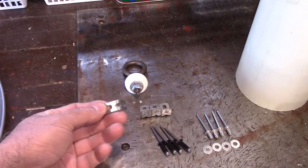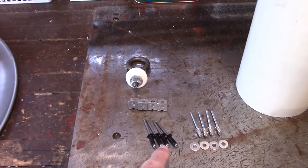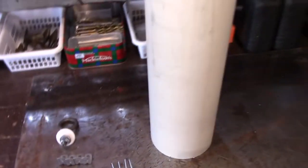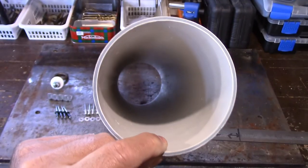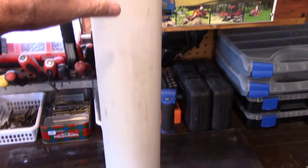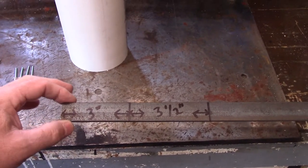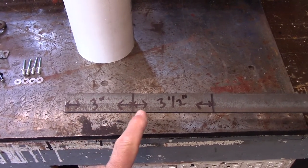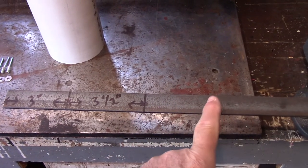I got these four little clips. I happen to have a whole pile of them, but all you have to do is just bend up some pieces of metal and drill some holes in. I've got 3/16 rivets — these are for the side, these are for the bottom — and some backup washers. This is the industrial part: this is 4-inch PVC plastic that you'd just get at your regular building supply. It comes in a 10-foot length for about $15, so you can make a lot. This one here is 20 inches long. And you need a hunk of steel for the top — 1 inch by 1/8 — and I've gone across 3 inches to the end and then 3.5 inches, and that last bend has to fit inside the top.